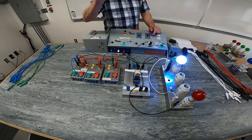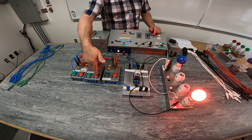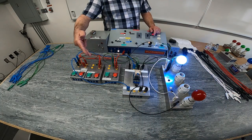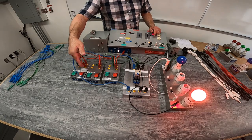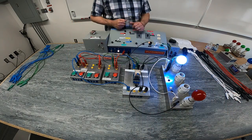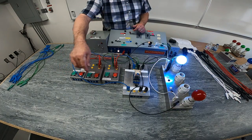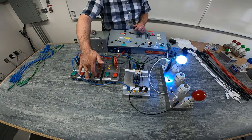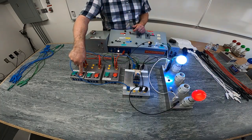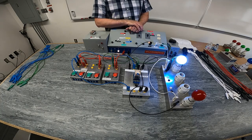If I were to press any one of my three normally closed push buttons, it should deactivate the coil and my armatures will release — what was normally open will become closed and what was normally closed becomes open. Let's try this one — they switch positions. Turn it on again, let's try the second position — there we go. Turn them on again, third position — there we go. Three different positions: energize from one, de-energize from one, de-energize from two, de-energize from three. And every time my lights change positions.